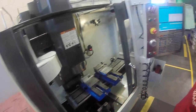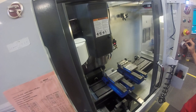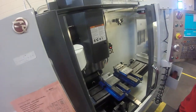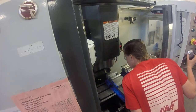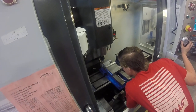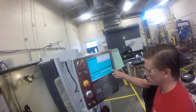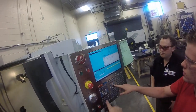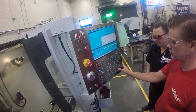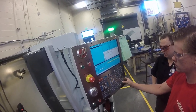That height's pretty good — you can just walk around the corner and get to the other side, go in the Y direction. Make sure you're clear. This direction is always easier to see. So that's going to be our Y coordinate right there — 2.974. We're going to use part zero set again. Let's go back and do our shift — we're shifting a hundred thousandths, negative direction. And also we're shifting another fifty in the same direction.